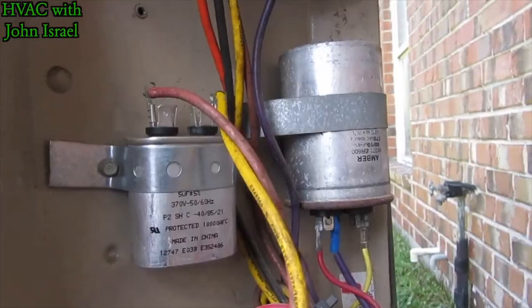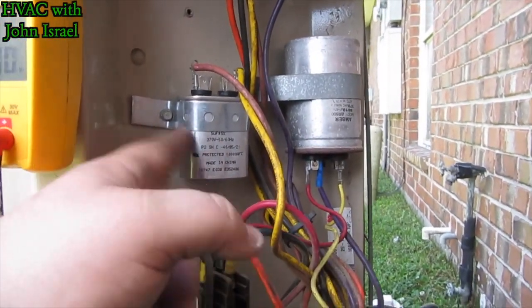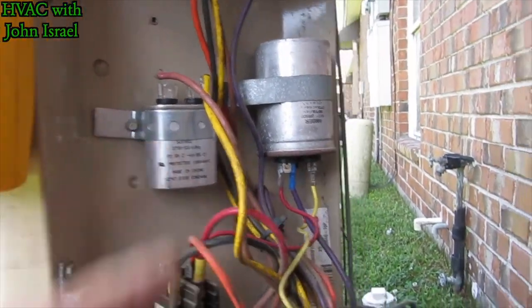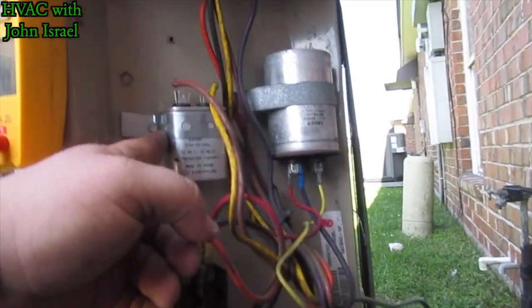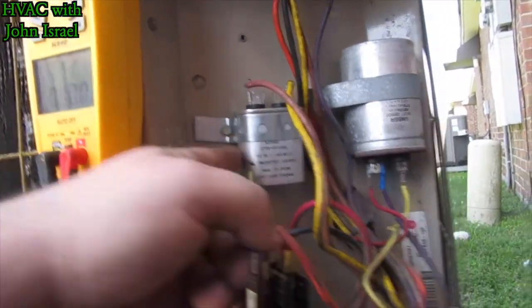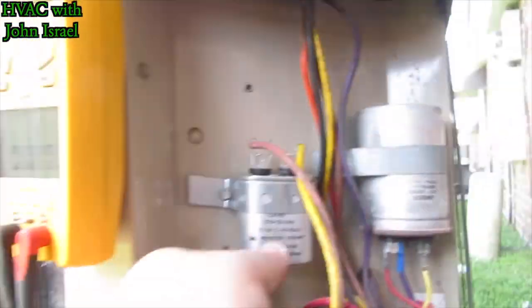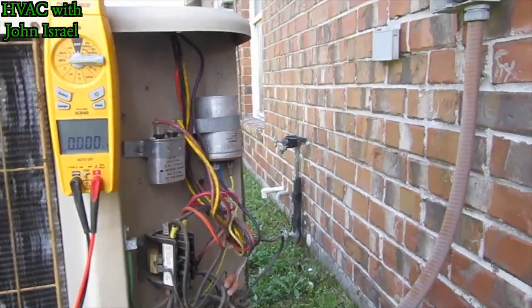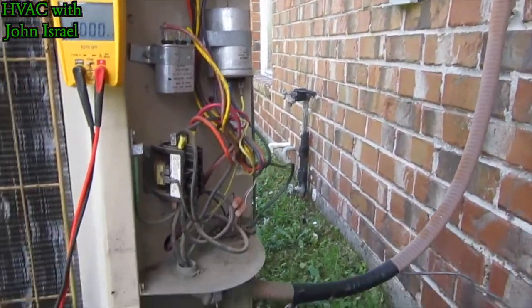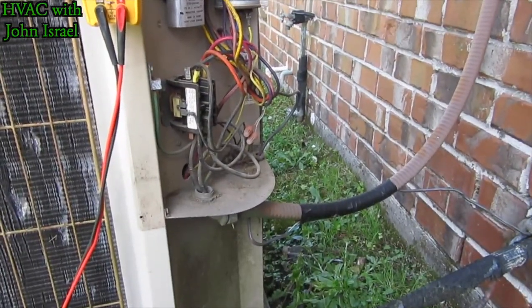a strap on this one. Okay, we got it all cleaned up, mounted it. I bet you I did that faster than they'd put all that tape right there. I didn't even have to drill holes. I used one of the Lennox screws there and then another one here, and it ain't going nowhere. All right, now I'm gonna have him cut the power back on and we're gonna see if we got a bad contactor or what's going on.